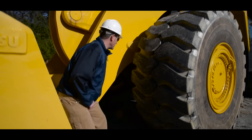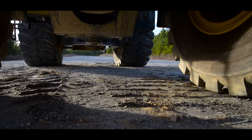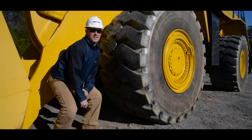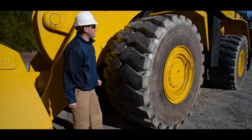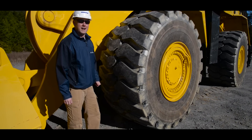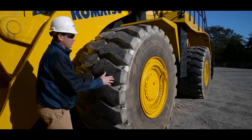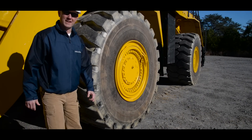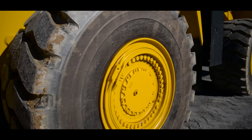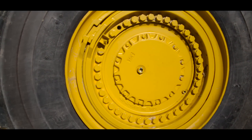Now let's take a quick look underneath the front of the machine to make sure that there's no leaks. If everything checks out okay, we're now going to move on to the tire and wheel inspection. This will be the same inspection that we do for all four tires. We're going to look at the inner and outer tire and wheel to make sure it's free of any damage, and check the hardware to make sure everything's there and properly tightened.